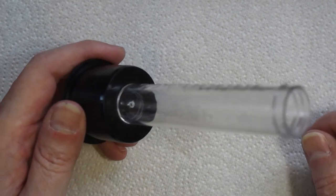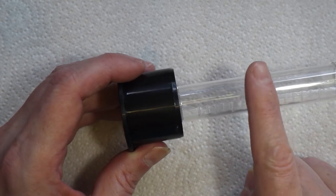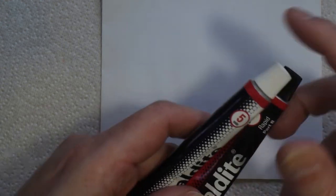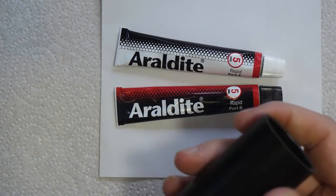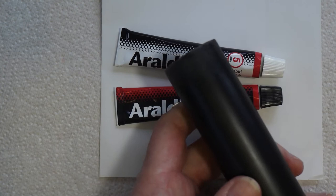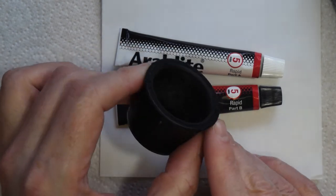Just a few seconds of sanding and that's now a really nice fit in there. I'll glue it in to make sure it stays permanently. Before I stick this to the pipe I want to attach the cap to the pipe first, then attach this bit afterwards. Before gluing, because this PVC is quite difficult to glue due to its very smooth surface, I'm going to take a bit of sandpaper and rough it up to give the glue something to grip to.